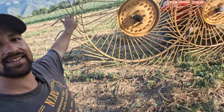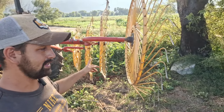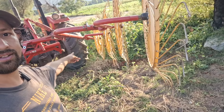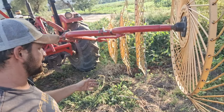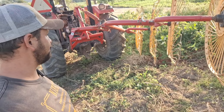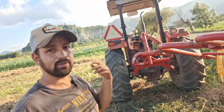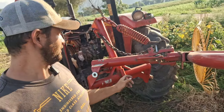Now let me show you how the rastrillo works up close. These are called 'soles' — sun-wheels. The soles are aligned so that the front one rakes first, then the next, then the next, and finally the last one — they sweep the debris from out there all the way over here, forming little piles. And because of the way they're shaped, when they hit the ground they spin. It's interesting because the rastrillo rests on the ground but doesn't dig in — that's what the big spring in the middle is for: it lets the rastrillo flex so it doesn't force itself and protects the implement.